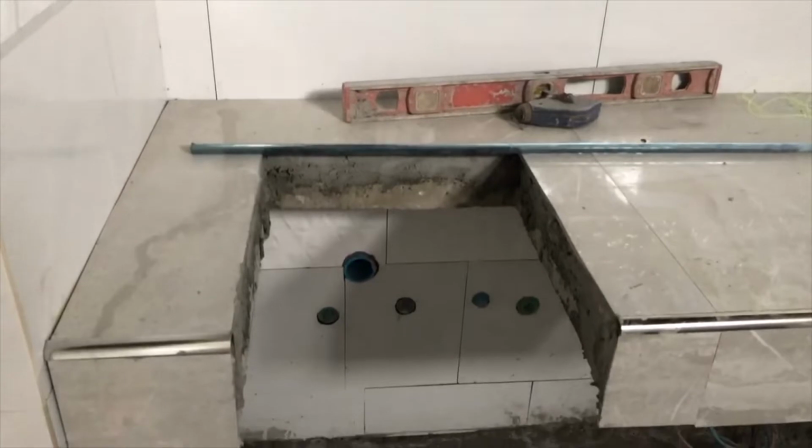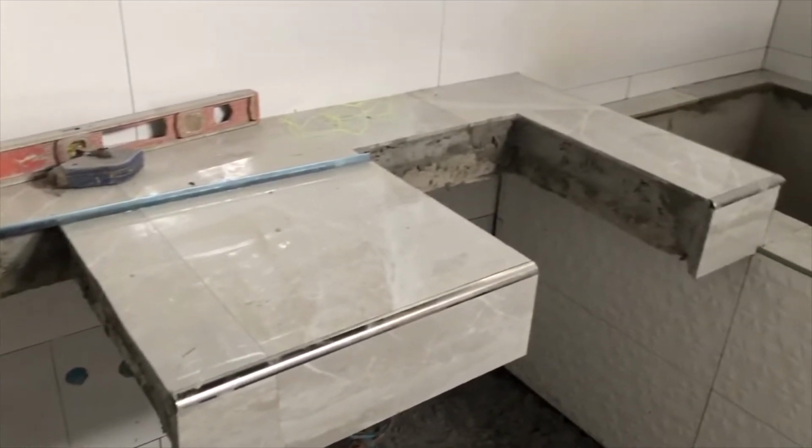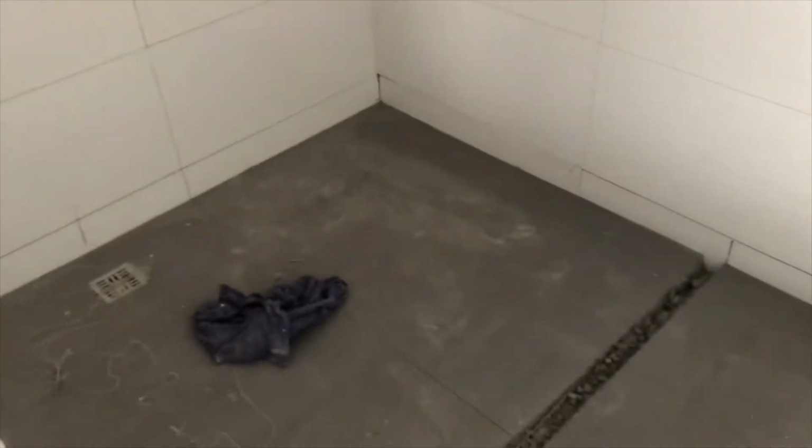This bathroom is the master bath. All of these taps are mixer taps, so they will have hot and cold water running to them. It seemed that the main bathroom is too far away to do that, so they're having its own separate hot water machine for that one. But these ones will run off an advanced hot water tank system. It's instant water, but it's not the ones that mount in the wall in the shower. This actually goes under the counter, and that's why there are a few extra taps and power underneath this counter here.